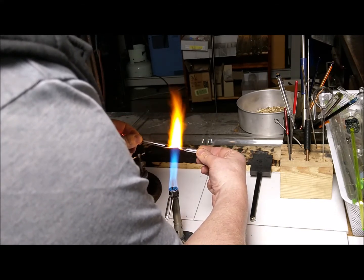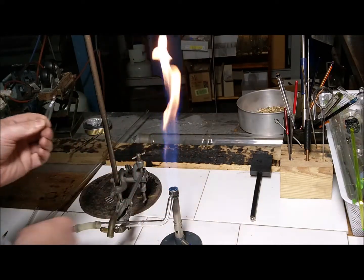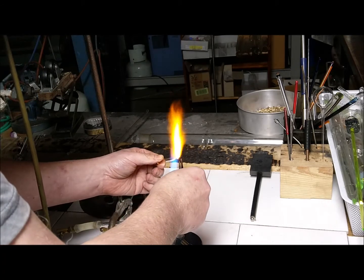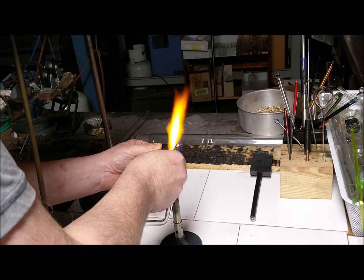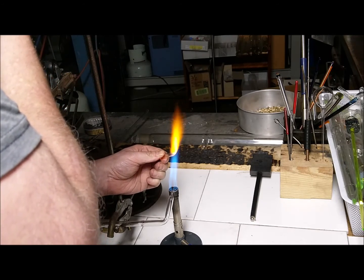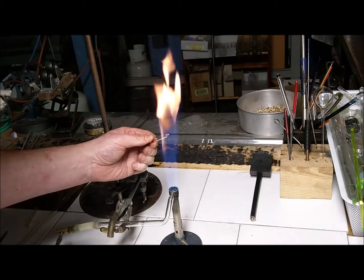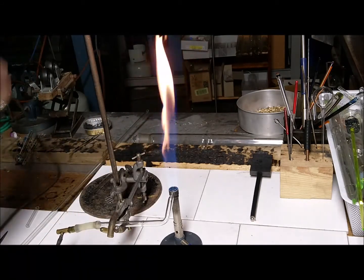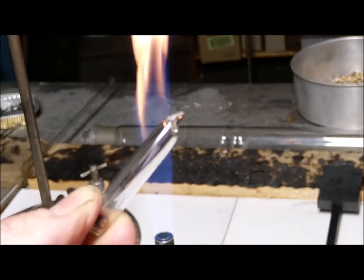Now if you just pull really quickly, it'll form a big long string. But notice I'm doing this little twist action where I'm spinning the glass around, pulling the string onto the blob. Even though it's made a little bit of an uneven blob, I'll just use the tweezers to pull that end off and clean it up a little bit — a bit of a twist — and melt that back in really nicely. Now just take it out of the flame gently so it cools down slowly, and put it back in the Bunsen to cool down even further back to Bunsen temperatures. That should be very close to annealed. Have a look at the top — it's a nice little seal. There shouldn't be any crimps or implosions and that should be good to go.